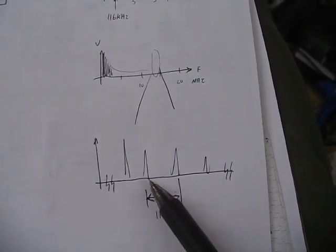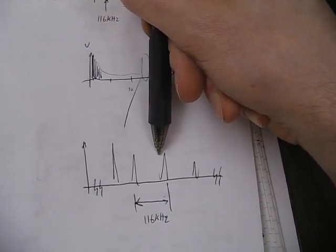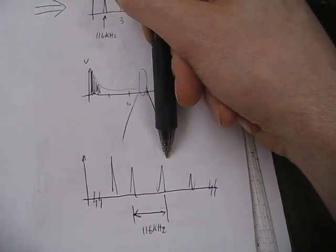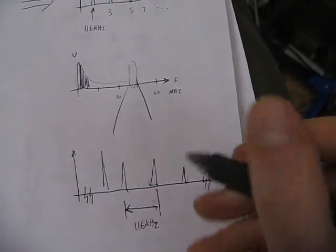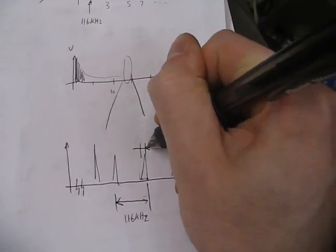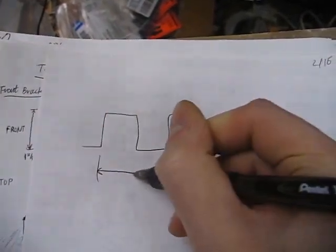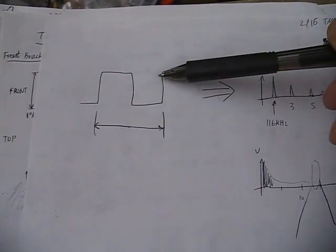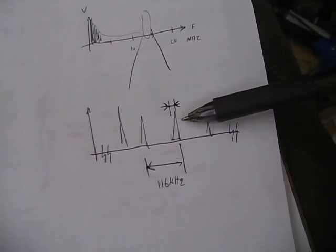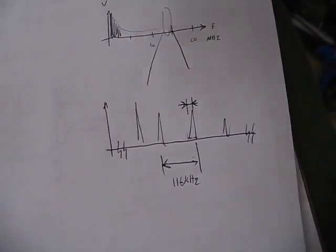So what we're doing when we tune across here: the receiver sweeps through nothing, nothing, nothing — and hits a spike. The relevance is that the width of each spike corresponds to the variation in various aspects of the waveform — variation in pulse width, variation in period, all of that. That variation looks like a modulation, so you get sidebands around not just the fundamental but every single harmonic, because every harmonic is simply a multiple of that.